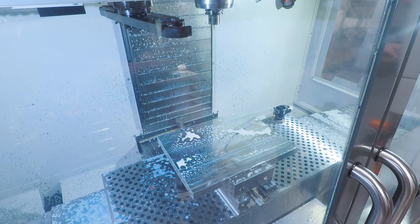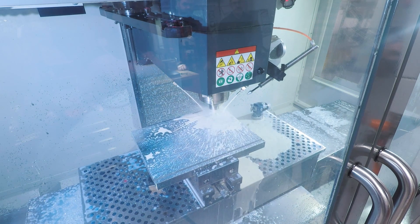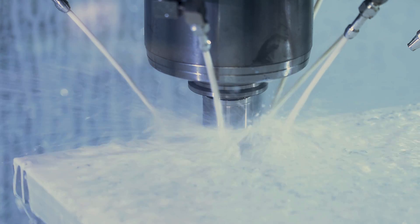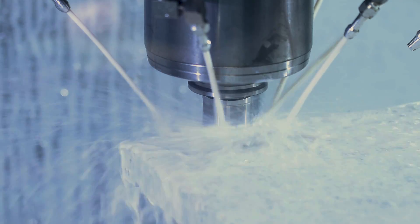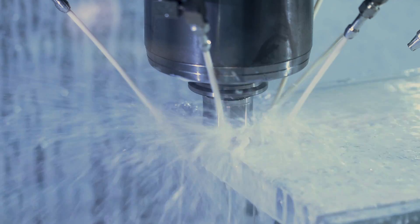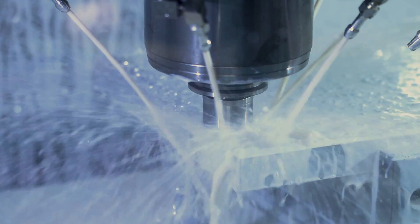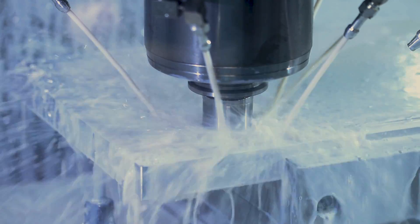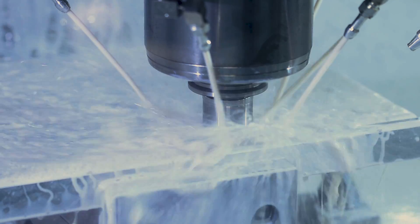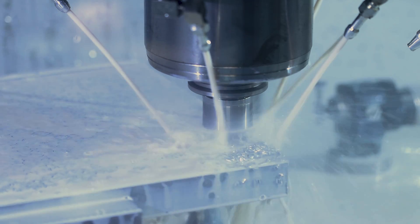And finally, let's step up to the Haas VF2. This is really the endurance test. If you've got a production-level job or you really want to understand process reliability, we wanted to put it through the gauntlet. This is 26 feet of slotting — over 310 inches at two times depth. Running this on a 16 by 12 inch piece of aluminum, cutting at 12,000 RPMs and the same 2-thousandths of an inch feed per tooth that we had on the MX, which is 72 inches per minute, but stepping down at just shy of two times diameter, or 0.48 inches deep.